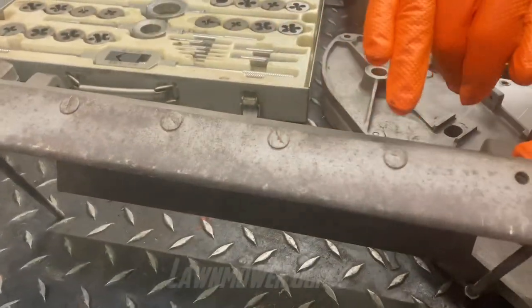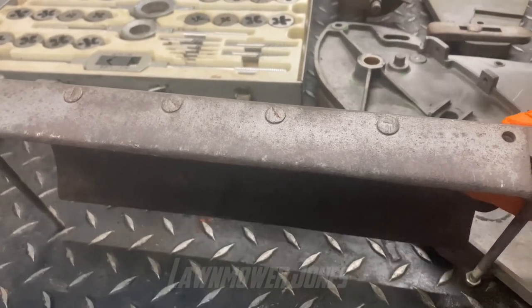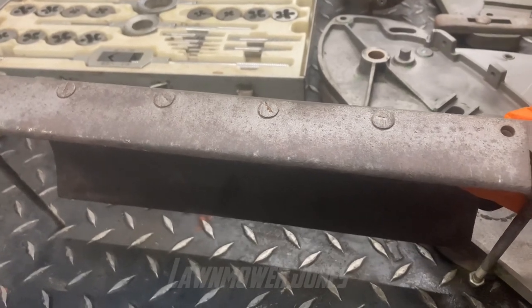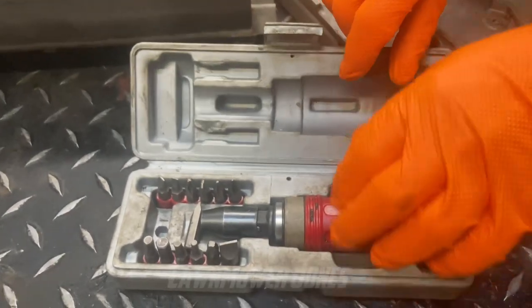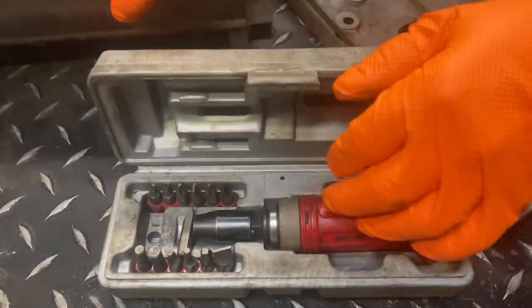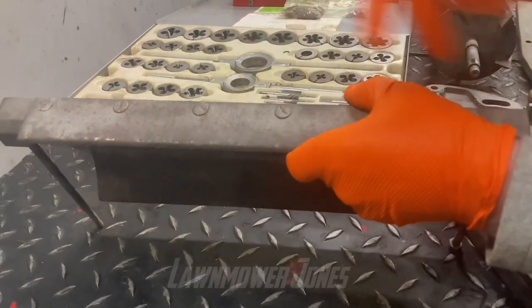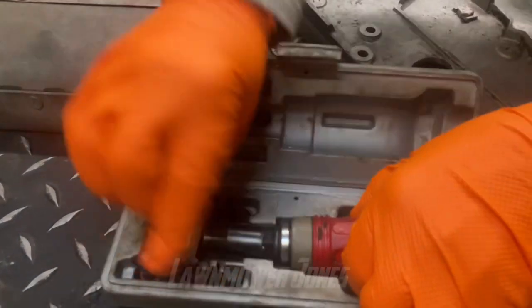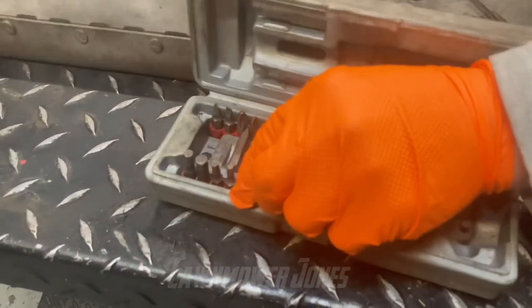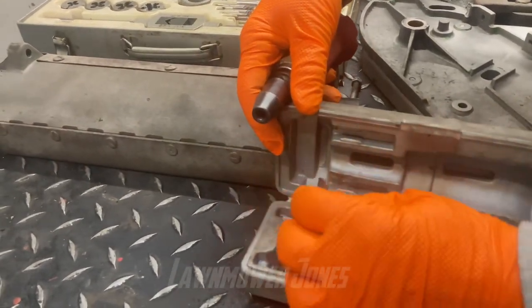You can see they're not going to come out very easily, and there are lots of ways to possibly get these out. You could use something like an impact driver, which most people have seen. And in the case of an ordinary head you'd probably just use a hacksaw to just clean it up a bit so you can get your screwdriver slot in there. Obviously you'd put it in the vice.